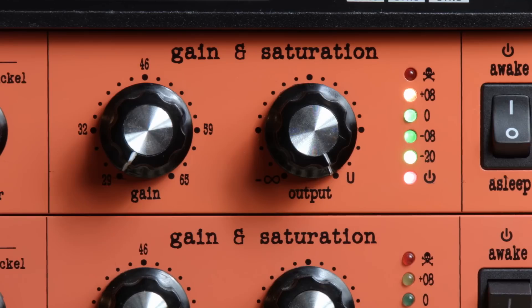That's a little bit about how I dial in a really hot preamp for something like a guitar. I love doing it, and when you have a built-in attenuator it makes it a lot easier. I have a couple of different preamps that have that feature — it's definitely a plus. If your preamp has that built-in attenuator, it makes this process a whole lot easier. Otherwise, look up a U-pad on Google. It looks like a U with the shape of the resistors, and you do have to know a little bit about soldering. But it's a very effective way to attenuate the signal coming out of your preamp.